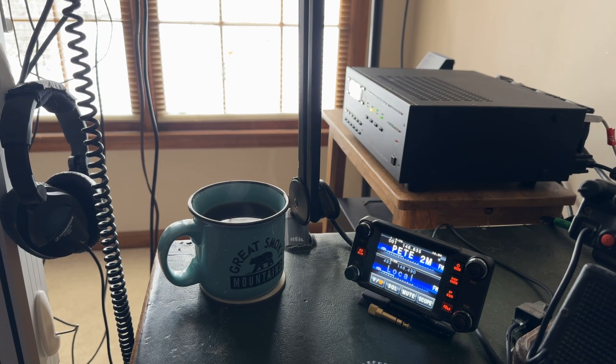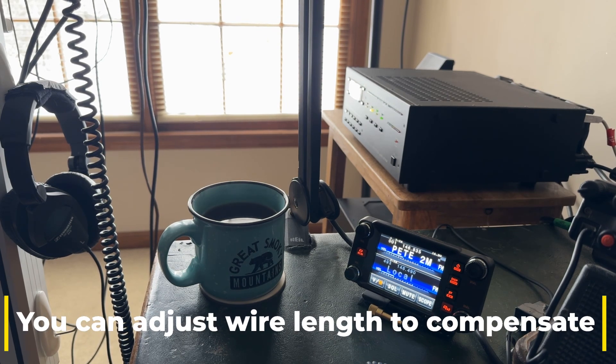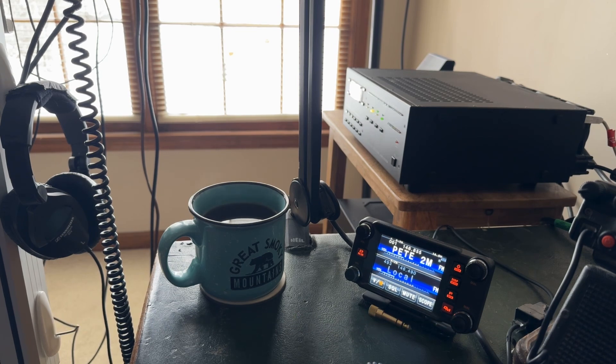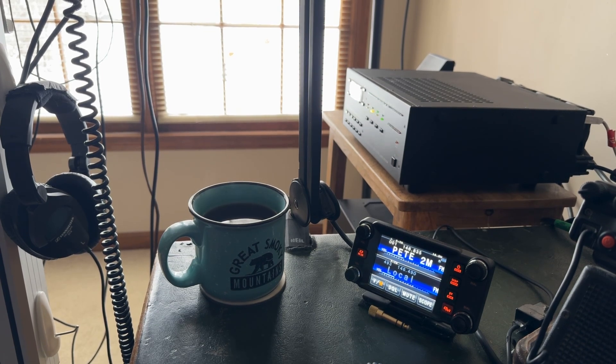Even a dipole is approximately 73 ohms. When you connect 50-ohm coax to a dipole, you can expect a 1.5:1 SWR. I had a discussion on that this week. 1.5 SWR is ideal. I had a guy make a negative comment on one of my videos using a derogatory term regarding a 1.5:1 SWR. Well, that's garbage — 1.5:1 is really considered good.